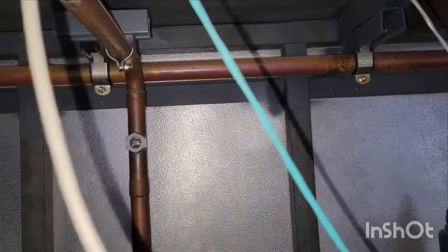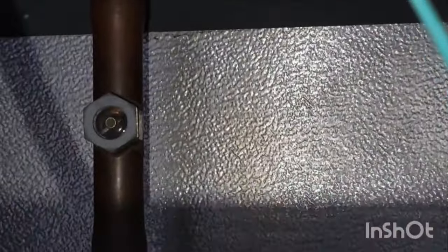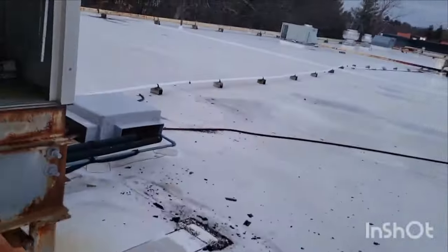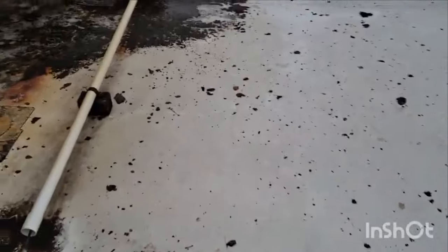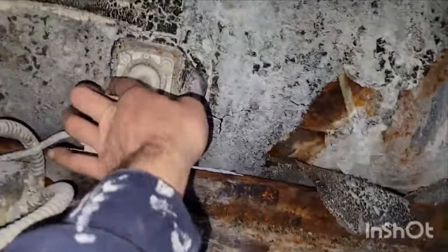Now also, you can see the sight glass up there, right? You wanna be concerned with your refrigerant level. Now, that refrigerant level doesn't look great. It could just be a low load condition currently, but you have to check the receiver to make sure. And in all honesty, it could be both, because I know for a fact that that oil is a problem right now. In my opinion, that is 100% the problem. But now we're just gonna check over here.